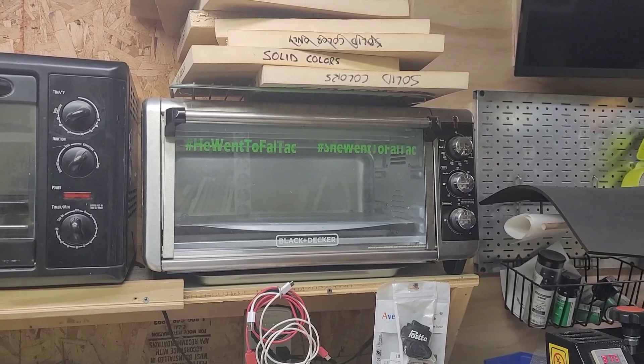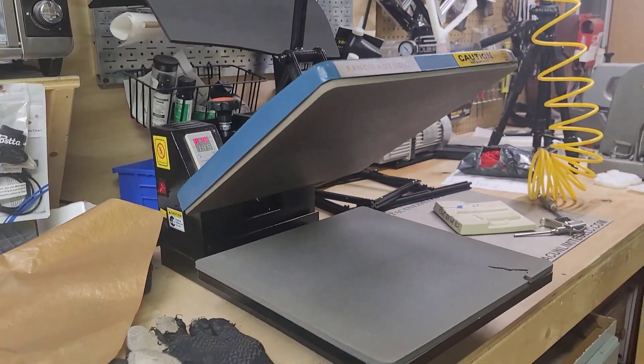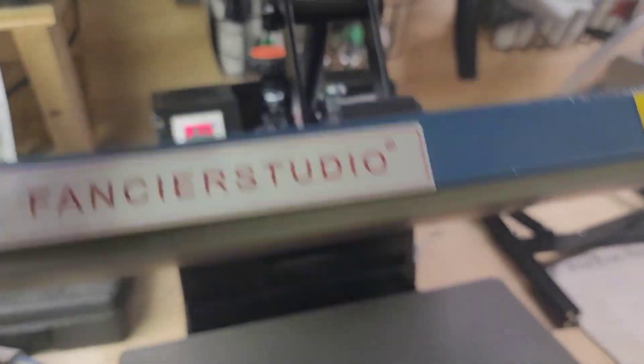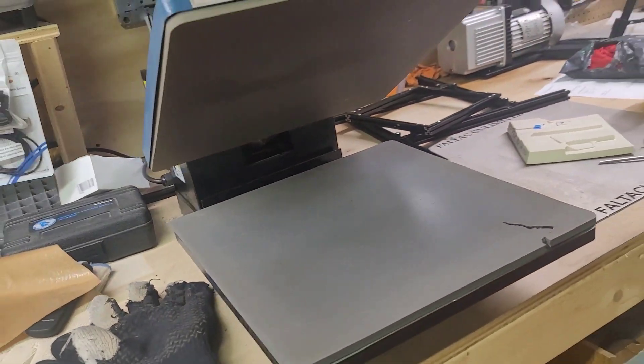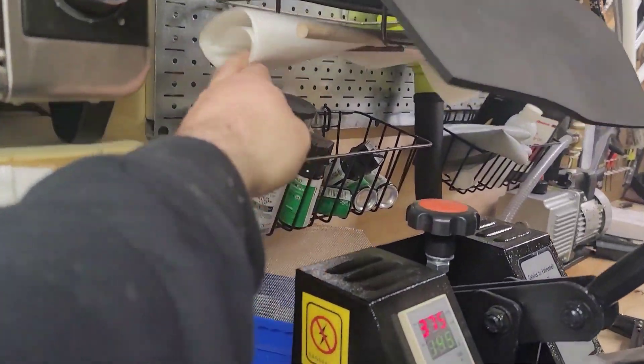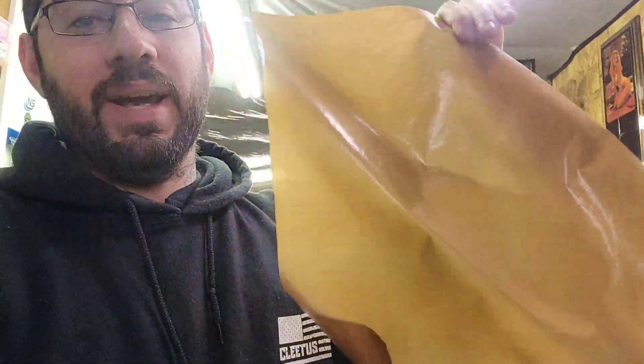Once you upgrade from the ovens — I still use these a lot — you can get a heat press. This is a 15x15 inch Fancier Studios heat press off Amazon, about $230. It usually comes with a nylon sheet, but that nylon sheet is junk — you don't want to use it, unless you want a small grid texture on your Kydex holsters. I personally don't think it looks right. So what you want to do is go to heatpressnation.com and get yourself a nice Teflon sheet. This one is 16x16 and it was $16. World of wonders.